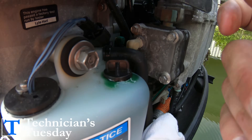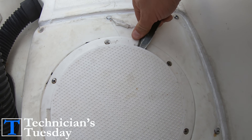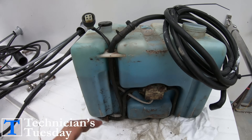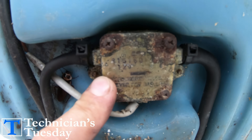The biggest of these differences is that the Mercury system operates by using crankcase pressure to pressurize the oil tank in order to feed the oil from the reservoir tank in the boat to the main oil tank on the engine. Whereas Yamaha uses an electric pump in the reserve oil tank to pump the oil up to the engine.